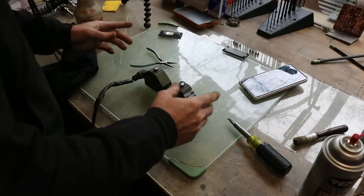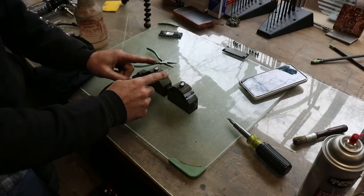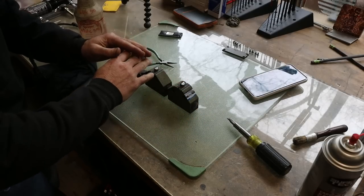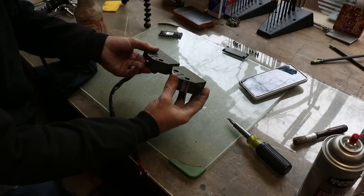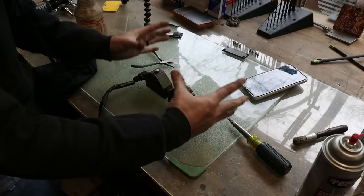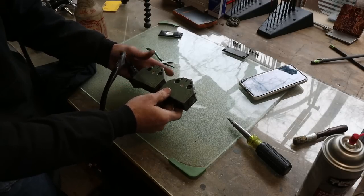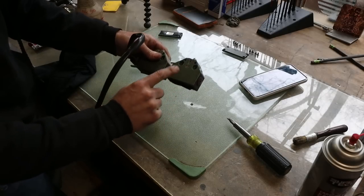So on the workbench here, I have the limit switches that come off the very front of the saddle of the DoAll milling machine. These are what stops the table, where you set the end stops, and it pushes down on a little plunger as they pass by, a little tool steel plunger that we have here, and stops the power feed. They're limit switches. Make or break a connection. Really, really simple what's going on here. But the problem with these, and the reason I got them out on the bench, is that they're sticky. Not like they're sticky on the outside. The tool steel plungers are sticking in the body of the actual switch, so they're not going to work, basically. So let's see if we can't pull these apart and get them unstuck.